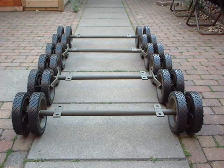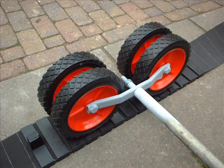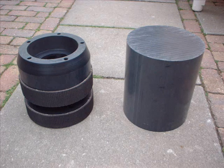The road wheels are 24 lawnmower wheels of 175mm diameter. The first and sixth set of wheels on each side are mounted in a fixed position to the hull to ensure tension on the track. The second, third, fourth, and fifth sets on each side are mounted on bogies to give it a more realistic look and improve traction. The drive wheels are 180mm diameter Delrin plastic wheels machined on a lathe. The drive wheel is mounted directly to the motor, allowing a top speed of about 7 km per hour — safe and fast enough for a child to drive a 150-kilo weighing tank.